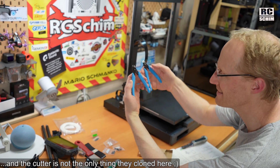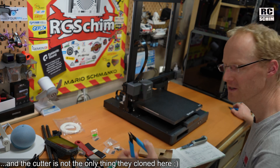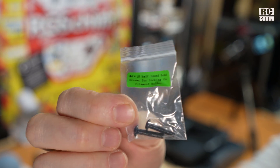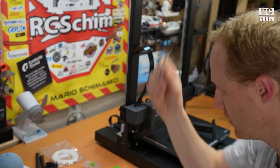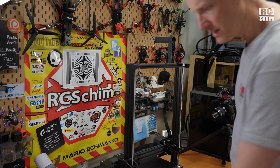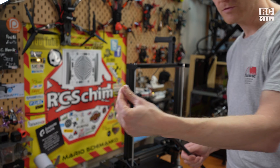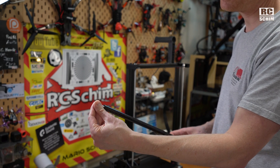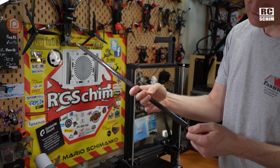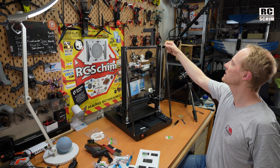This is 100% the same as the one Creality uses on the K1, but I really love those things. The little screw bags have labels on them — makes your work way easier. Screw on the filament holder. Now I'll install those structural rods. You can make those things longer by unscrewing them, so we need to find out the right length, with spaces on the inside between the case and the rod.